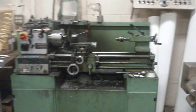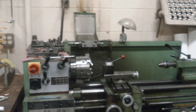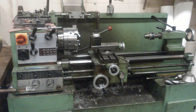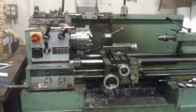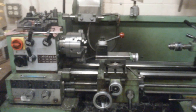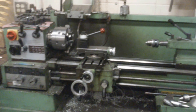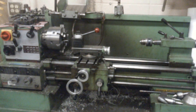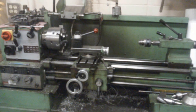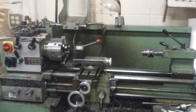This is one of my favorite little lathes that we have here at the research facility. It's a Maximat Super 11. It's got induction hardened ways and I'm not sure on the swing — I'd say eight inch — but it's got a six-jaw Buck chuck on it which is really nice. We don't have a four-jaw for it at the moment, but if I needed a smaller lathe I would look for something like this. It's a real pleasure to use, quick and easy — not good for hogging material but for small precision pins it really does a great job.